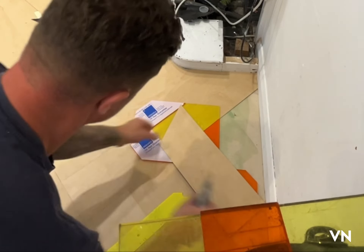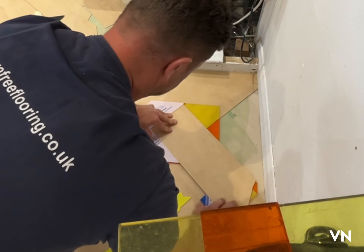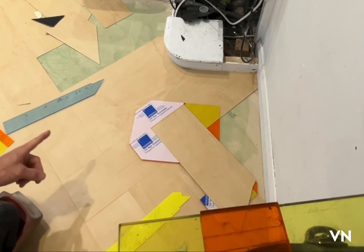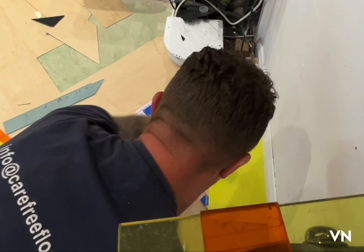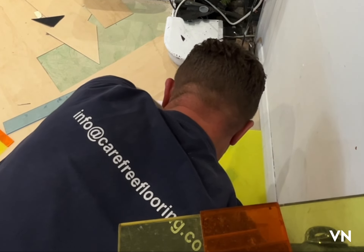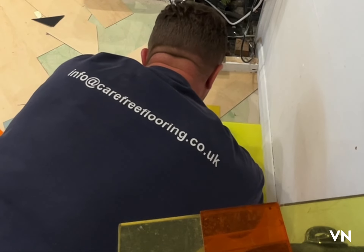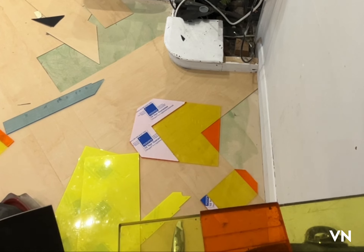It's an important part — without it you will shift by half a millimeter without knowing. When you run it, that'll probably go in without roughing in — just spin it around, it'll go in. If you haven't got to rough it in, don't. That's the 45. Good boy — always straight line now. Left hand pulls it back into the board, that's it. Let your right finger guide you on the template — one hand on it, you don't need two. The knuckle holds it on top — pull the template with it.